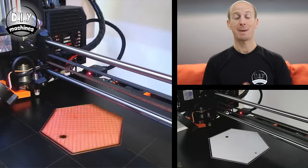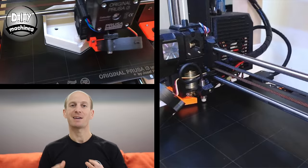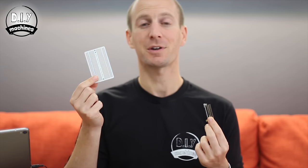Let's get started. Depending on which layer height you choose — I did mine at 0.15mm — the 3D prints may take some time. Whilst they're printing, we'll start assembling our circuit board. You'll find that your soldering goes a lot better if you have some common tools: soldering tin, a soldering iron, wire trimmers, and some helping hands. I'm going to show you step by step where to solder which wire using the coordinates — the letters and numbers on the board. You'll also find a circuit diagram in the description below.